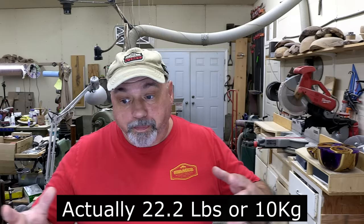I think it was around 20 pounds before, so we definitely turned away a lot of fat on this one. Hopefully you enjoyed the video - it was an awesome project to turn. You gotta be really careful with vacuum chucks. On a solid piece of wood that thick you don't have to worry as much, but what happened was the sanding and buffing create a fair bit of heat from friction, and right after sanding and buffing the resin got warmed up and more pliable, and that's when it started to suck in with the vacuum. Keep that in the back of your mind if you're doing something like this.